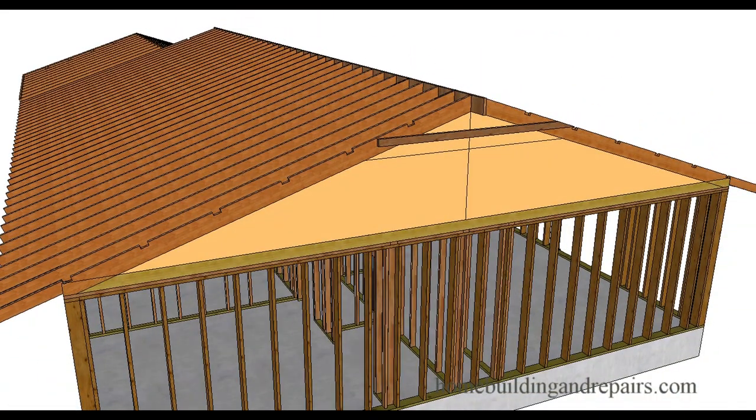I hope that makes sense and was helpful. If I install a collar tie, I put it right underneath the ridge. For nailing, I would use a 2x4 and put four 16d nails in each side of the collar tie. Remember, I am not an engineer. Building code information can be interpreted in a variety of ways and isn't always going to be interpreted to your satisfaction as a contractor, builder, or homeowner.